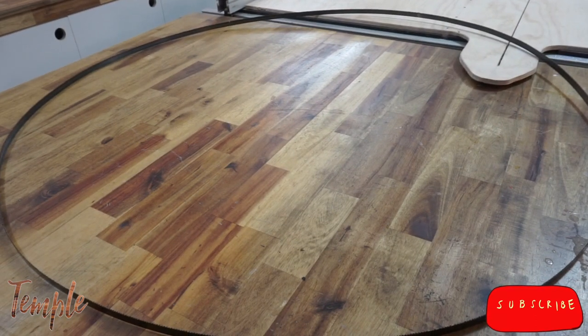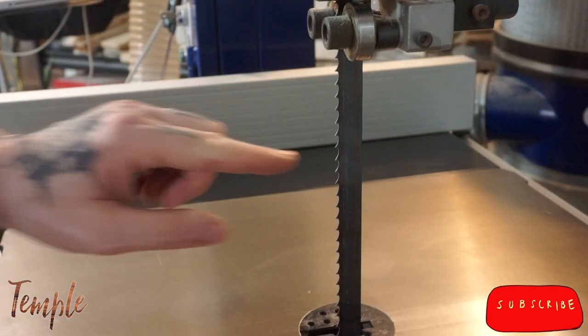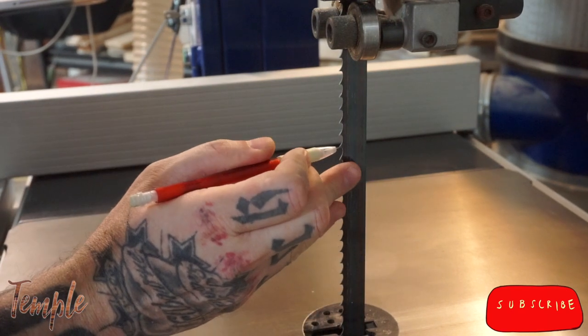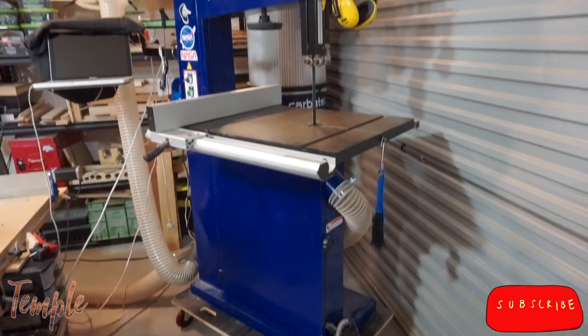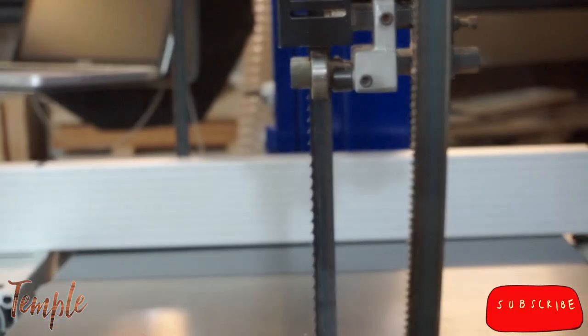The biggest factor in re-sawing is the blade. You would intuitively assume that more teeth equals faster cuts, but that's not how it works. Lots and lots of small teeth give you a much smoother cut that will require much less sanding to finish. In order to chew through big chunks of wood, though, we need less but bigger teeth, bigger spaces between them called the pitch, and deeper gullets to clear waste material. A term you'll hear when shopping for bandsaw blades is TPI, which means teeth per inch. Most of the smaller bandsaws I've bought in the past have a TPI of between 10 to 14. For re-sawing, the TPI I use is 3. That's a big difference.